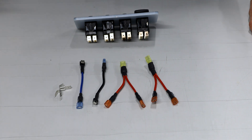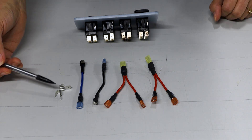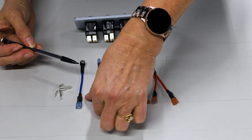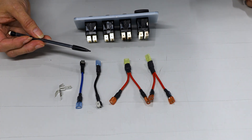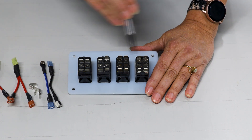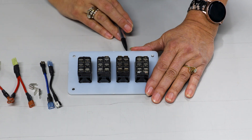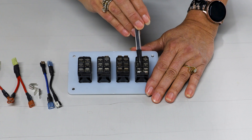Here's what you're going to need to wire a 10-terminal nav anchor switch: two piggyback terminals, one blue jumper with piggyback, one black with a piggyback, and two bifurcated three-connector jumpers. We're focusing on the 10-pin because it's so crowded in there and it's the one that people have the most problems wiring. We need to power up this switch — remember it has two poles. This is pole one and this is pole two.